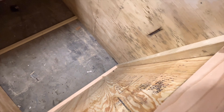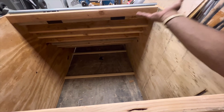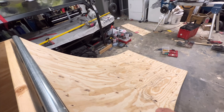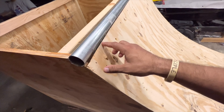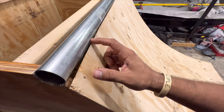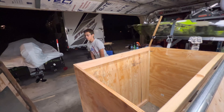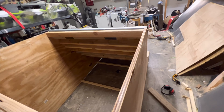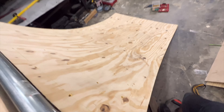Looking inside, we squared off the front and back — we should have done that earlier instead of looking down inside, because that's where it became a little uneven, about a half inch off on the other side where we'll need some trimming. For the conduit area, I took thin pieces of sheet metal, tapered them to the bottom, and attached them underneath to one of the studs building up the ramp, then cleaned it up so there's no hanging stud to catch anything on or hit your wheel. After remodifying, the edge didn't fit flush, so I built it up with thick epoxy. After it cured, we put the top on and resin-coated the entire thing with countertop epoxy — Armor Light from Hobby Lobby, or you can order it on Amazon or eBay.